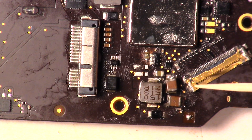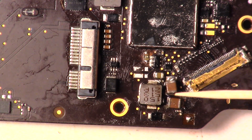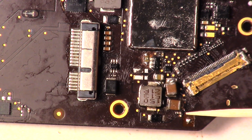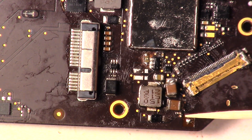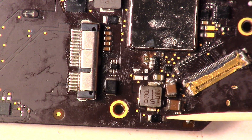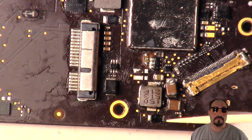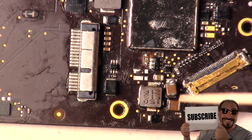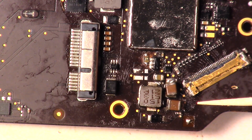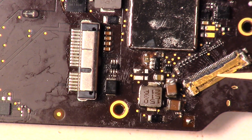After that, I would check this component right here. When you do change these capacitors, you have a very good chance of accidentally taking out this little capacitor right there without even noticing — which I did, and then I replaced it. You want to check that as well, and you check it with a multimeter. I'll leave a description of the video link below — it actually shows you the measurements. You can go through that and check each component, and you can also check all your pins.